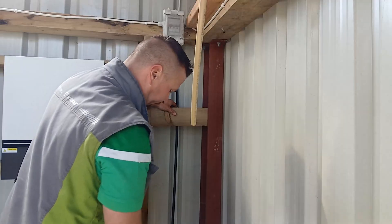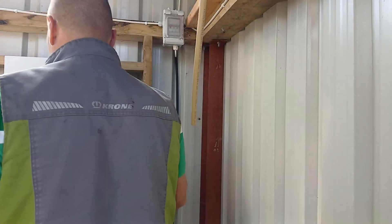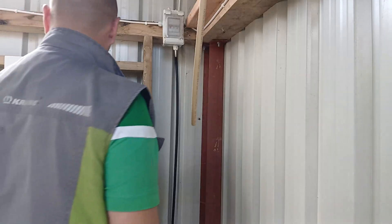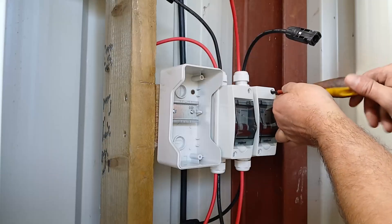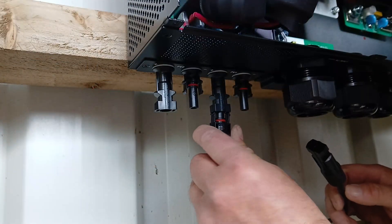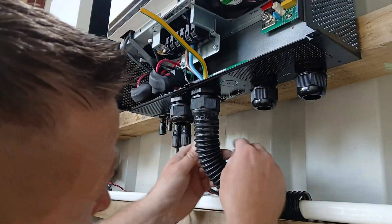It's here for the fuse boxes. Nice and handy, the cables just come up out of there. Perfect, nice and tidy. You can walk straight in and see if trip switches are blowing — there's a problem somewhere. Wiring up the inverters is one of the easiest parts of this job, and once all connections were secure, we could then move on and begin to assemble the low voltage DC side of the system.